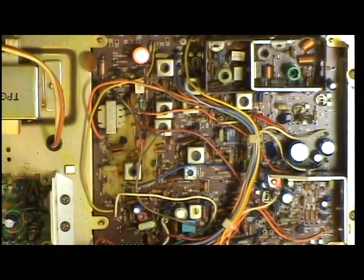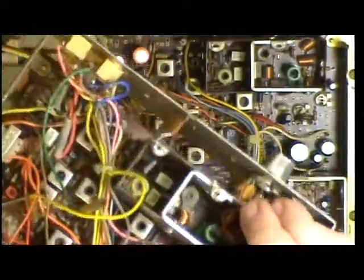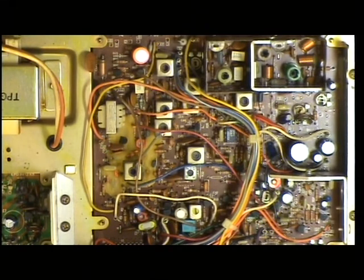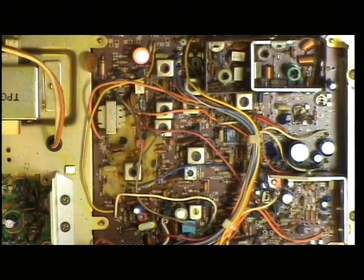Well, I've ended up changing the crystal. I didn't have to go into our new crystal drawer - there was a scrap chassis here. Unfortunately we've got a very nice York 863 which has been totally wrecked by some gas poker driver, so it's one that gets used for spares. It's a shame when a nice set like that comes to such a demise. So that covers it - we've changed the crystal, set it on frequency, it's now doing 27.79125 on channel 20, doing a full 4 watts, and deviating properly with the metres set up. That concludes the transmitter part of the Harrier CBHQ - I'll see you hopefully on the receive side of this 1981 base station.